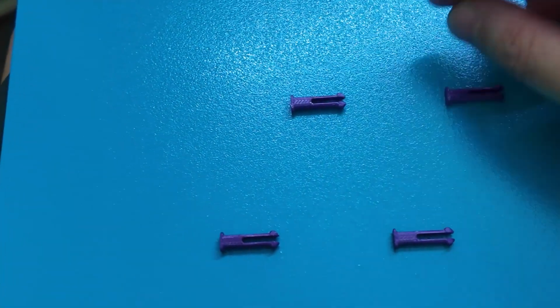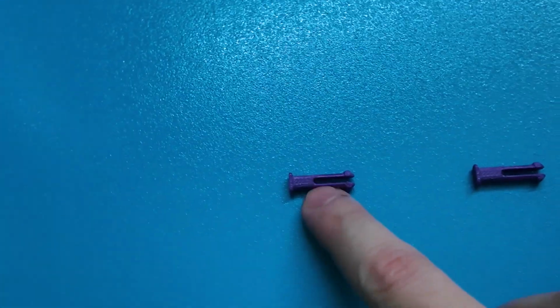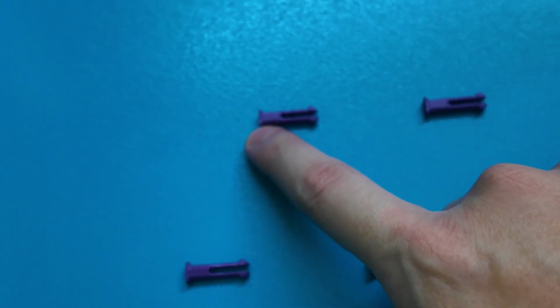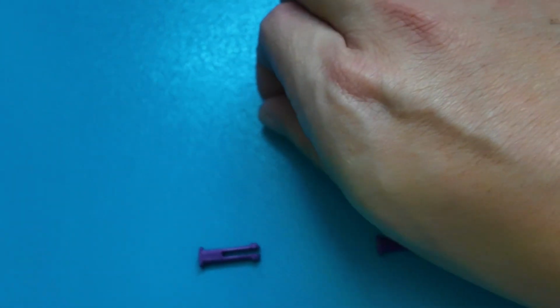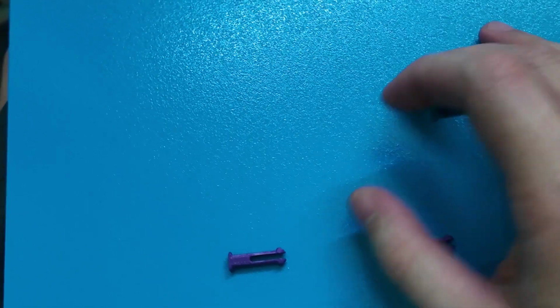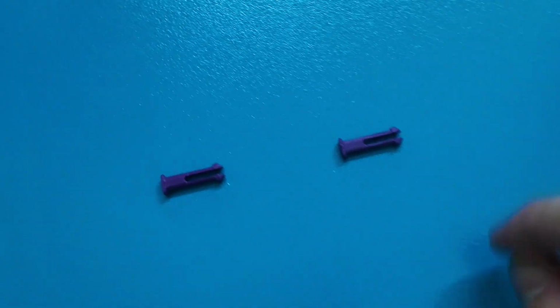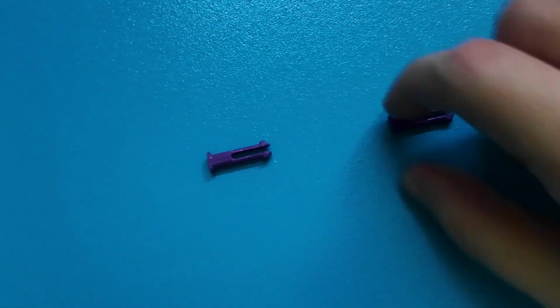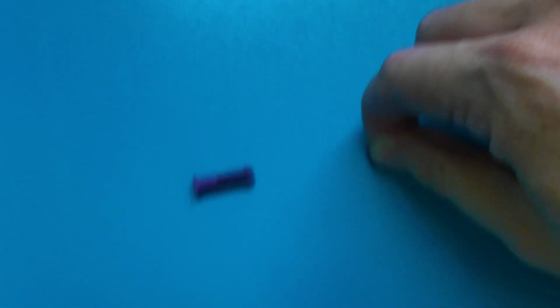Okay, back in the room. So you can see that the major point was here, where most of the filament on the first layer was on this part, and these are just 2 dots here. You can see that part moves, but still not that tight. But just flicking it, it is pretty tight. It takes substantial force to remove it, and this plate is 50 degrees. If this was PEI, it should have released already very easily. Now it's actually pretty tight.